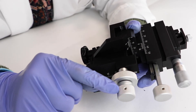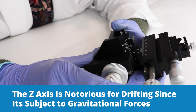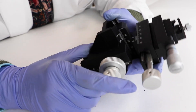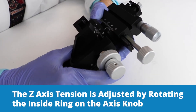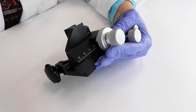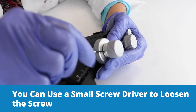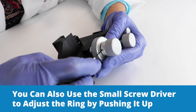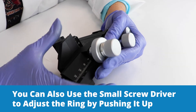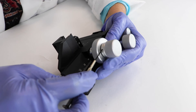Adjusting the z-axis is a little different. The z-axis is notorious for drifting since it's subject to gravitational forces from the weight of the entire manipulator body and the load. The tension is adjusted by rotating the adjustment ring. To do that, put the small screwdriver in there, loosen it up, and then use the screwdriver to push the ring. It can be difficult to turn, but if you have the screwdriver perpendicular to the ring, you can use it to push the ring up.